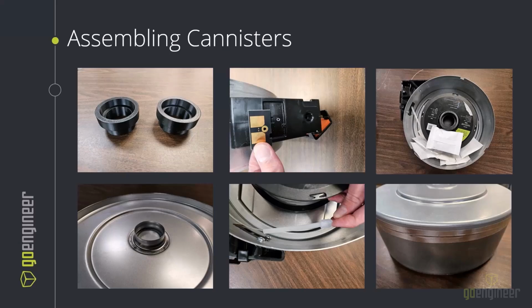So the existing reels inside of a preferred Stratasys canister, preferred material, there's big slots where you could insert these different desiccant packets. So that might be something else you could potentially print to hold in place or potentially tape them in there. I chose to just pile them at the bottom of my canister, but that does present its own risk, which is you just don't want them to get in the way of the wire and get pinched and prevent your reel from unwinding correctly.